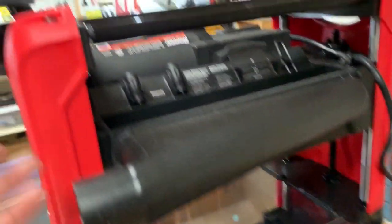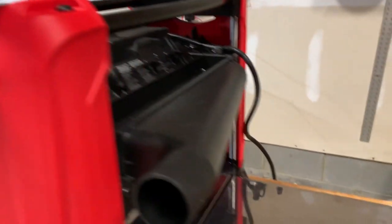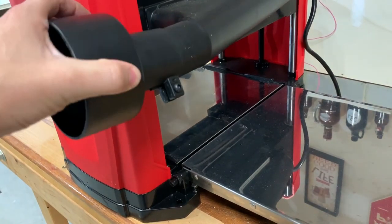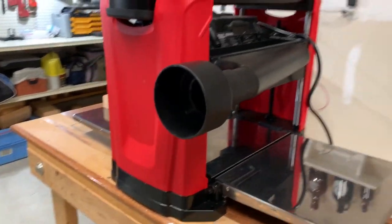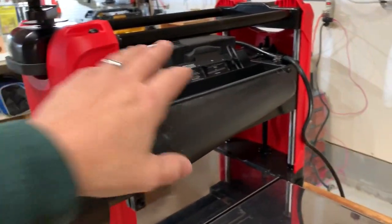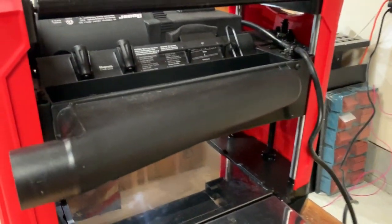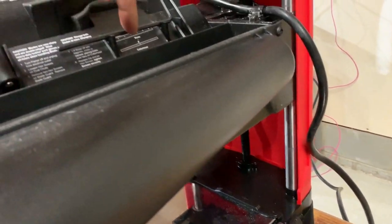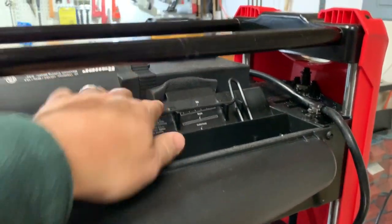Super simple setup. The only thing you had to install when I took this out of the box was the handle — you just kind of push it on and you're good to go. You also have to install the plate, which is the chute for your sawdust. It also came with an expander adapter — so this goes on here if you have a dust collection system with a larger hose. That is the only installation needed, which is two screws, and it has a seal so no sawdust comes flying out. It also came with two magnets for when you change your blades underneath, and an Allen key that fits here so you can remove the chute if needed. I recommend you don't lose that — keep it where it's supposed to be.